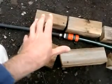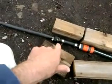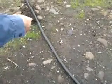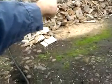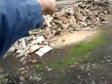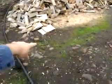Up, and that's it. It's basically designed to get air out of the lines. Long story short, when you have drip feeders in a vineyard, your first vine, let's say, we have the line coming out of the ground, that's our first drip feeder, and that'll start drip feeding. But when you've got all this air in the line that goes up another 50 metres, this one would have been dripping for 15 minutes, and the air's still trying to seep out of all the other ones up the end, and you say, well, it's had 15 minutes of water, I'll turn it off. Well, guess what? The water only got to those ones 50 metres away for 10 seconds, and then you've turned it off with 10 seconds of watering.